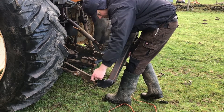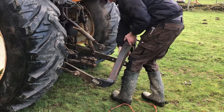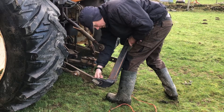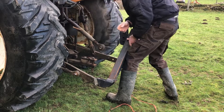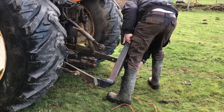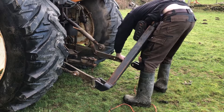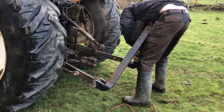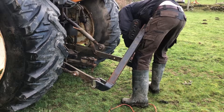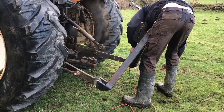Using the A-frame saves you lining up with an implement perfectly to connect each link. With this you just need to reverse up straight, lower the A-frame, and there's a receiving A-frame welded onto the implement. You just reverse up to it and hook it on, then connect your power takeoff. I'll show that in a minute once I've fitted the A-frame on.